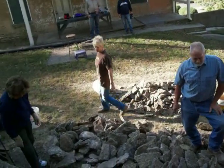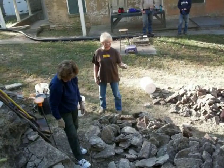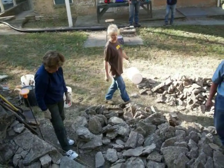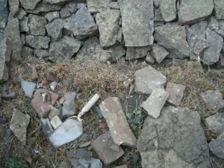So there will be thinner stones used in some places and thicker stones in other places, and you'll have to be very careful about not having any running joints. And we're going to fill solidly, just like you're doing now. This back area — before we start working on the face on the front — we need to get in the back area right there.